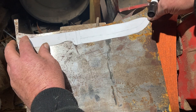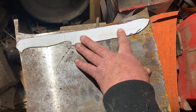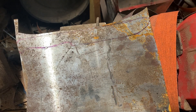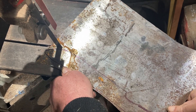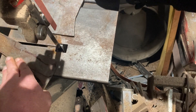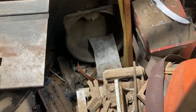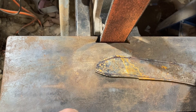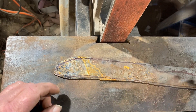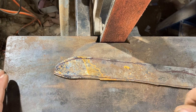I need to shorten it a touch. There's our basic shape ready to go — I'm going to cut it a bit big and then grind it back to make it fit just perfect. There's our basic shape cut out, nice and big — haven't even started on the handle, we'll do that on the grinder. Here we are at the grinder with a nice large tool rest. We're going to pull it into shape using an old worn-out 40-grit belt. This is pressure grinding — it's going to cut anyway. No need to use a new belt and I'm going to ruin a new belt if I do, so let's get to it.